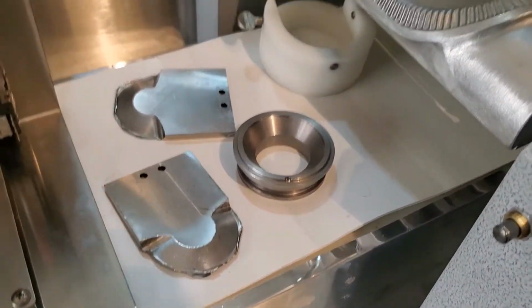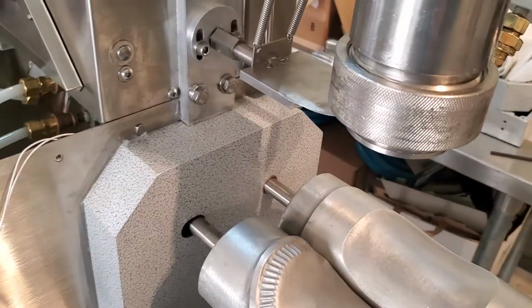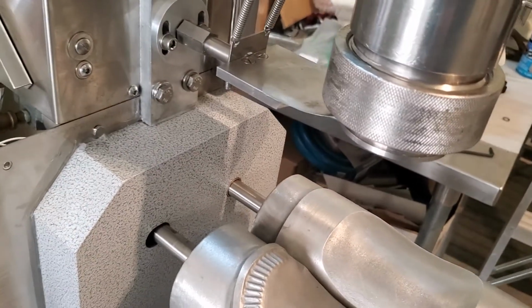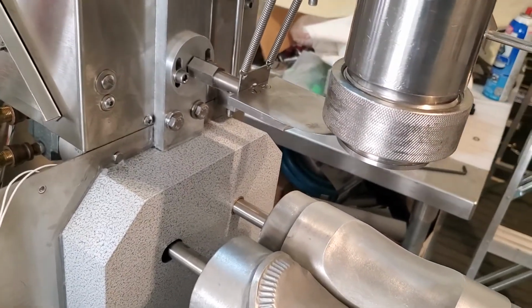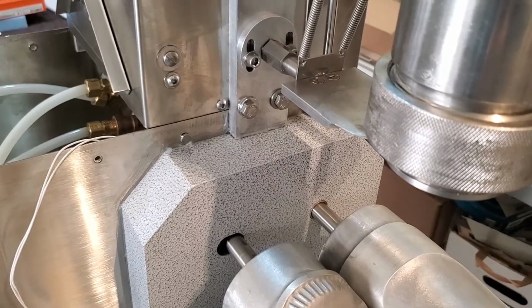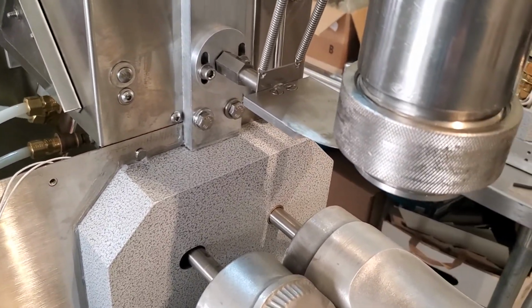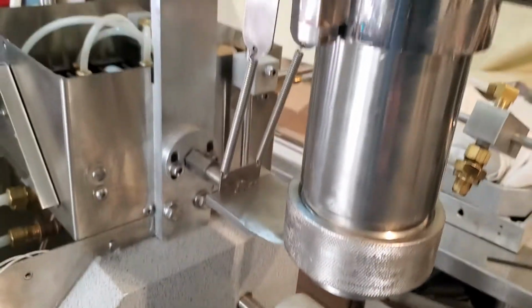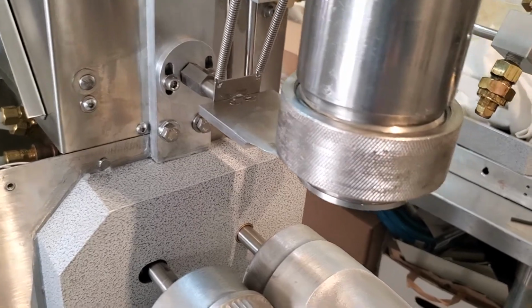In the previous tutorials, we started talking about safety and the knife. So I'll bring it up again. The knife, as I've said, you treat it like a running chainsaw. I cannot emphasize enough to always be aware of that knife, its position, what's going on with the machine, and when the hopper is not installed, that the knife guard is over the knife.